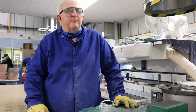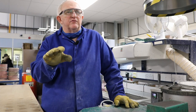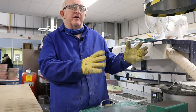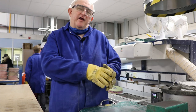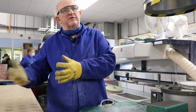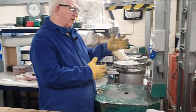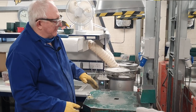There is a big black book of casting — before you could cast on a machine we would take you through the book. The science is in the standard operating procedures and that teaches you how to cast. Then experience tells you how to deal with each mold, because each mold is different — when they're cold they work one way, and as they get hotter they change the way they want to behave. Some don't want to behave at all.